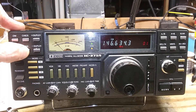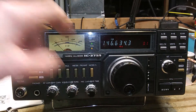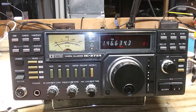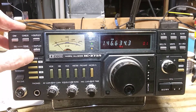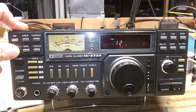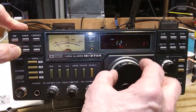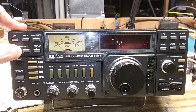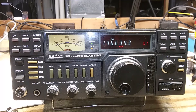This is the tone switch — you'll notice it just lit up. You have to push that if you're using repeaters. Even if you have everything stored in the memory, you have to push that anyway. This select switch will show you what the tone setting is. Back then, ICOM used these codes that you can change by holding that in and turning the knob. This one is on number 12, which is 100 hertz tone — very popular around here.